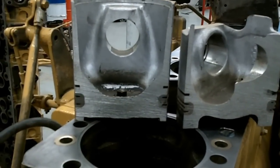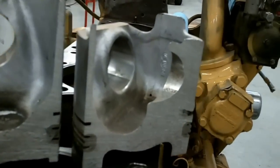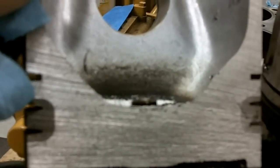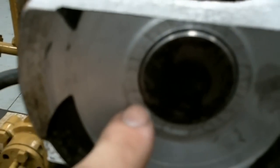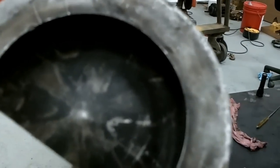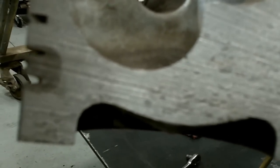The piston on your left is a 1693 D343 piston, and the piston on the right is a 3408 piston — a DI motor. This is how thick the 1693 piston is, and there's the nut that holds the plug in. You can kind of see the cracks — they're black and go around here — those are heat cracks from too much fuel. This is a 3408 DI piston. It has a fuel bowl inside of it, and you can see everywhere where the injector sprays fuel it's all clean. You can see it's not very thick out there at the edge — probably only about one inch — versus about two inches for that one.